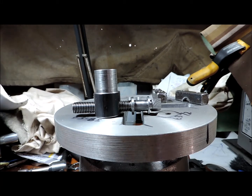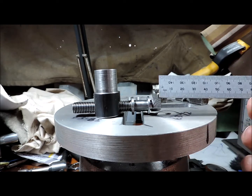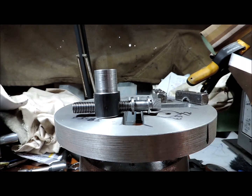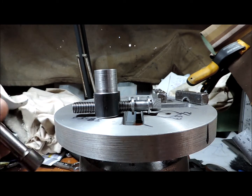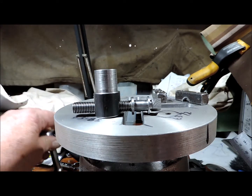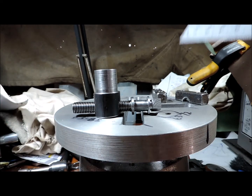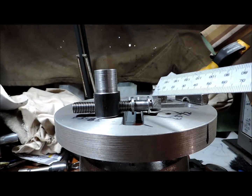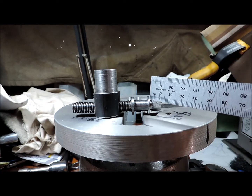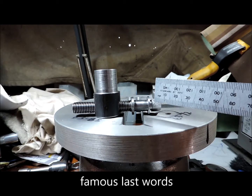I've finished the 4 screws. The end of the shaft has been taken down to 10.5mm — that's the engagement for the key, that's the key end. This shoulder has been reduced to 1.5mm, that's about a sixteenth of an inch. The screws should now be finished; I shouldn't have any more work to do on those.